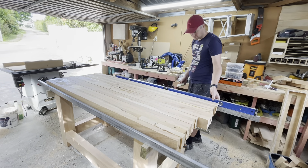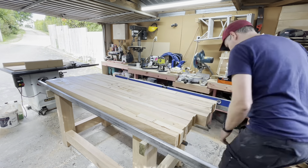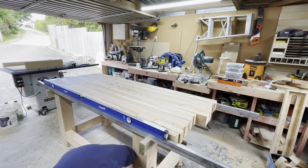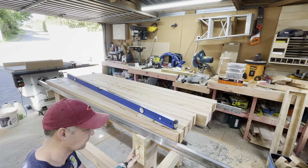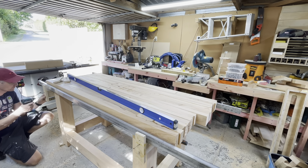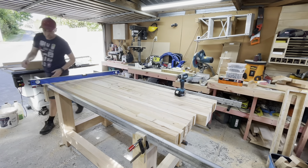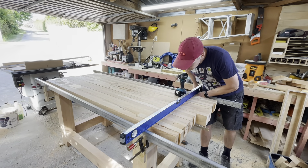I'm using two lengths of aluminum for rails, but you can use whatever you have on hand as long as it's straight. Clamp some pieces of 4x2 to the bottom of the table to support the rails, then make sure the table is level — I added shims under the legs. Screw some scrap pieces to the 4x2s to clamp the guide rails to. Clamp the guide rails and adjust them until they're coplanar. Keep the tops of the rails only just above the highest surface of your tabletop — if the rails are too high, your router might not reach the table.